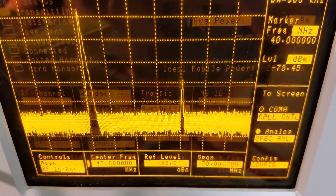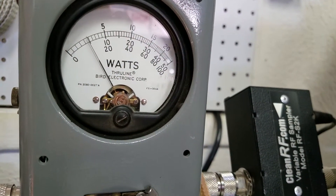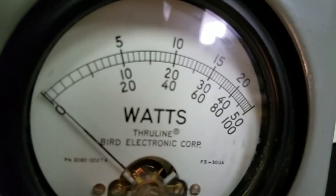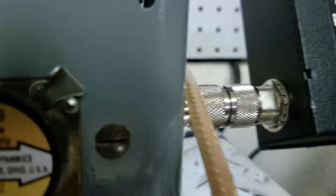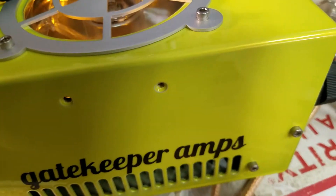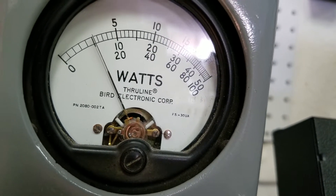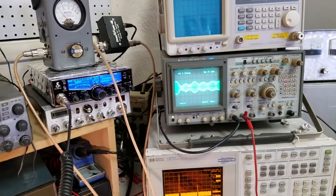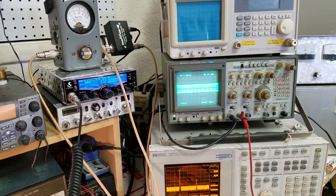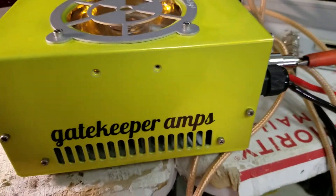Let's look at this real quick — one, two, three, four, five, four, three, two, one. This is a 2500-watt slug; I meant to put a different one in there but we'll go with it for this quick video. We're not really concentrating on watts, we're concentrating on whether the amp is clean, but I need to show the watts. That little tube pill is doing 250 watts PEP and it's clean. Audio check — one, two, three, four. Radio is doing a hair over 250 on peaks. It's looking good and working good.